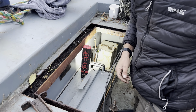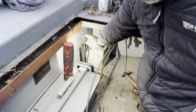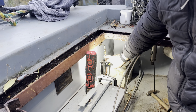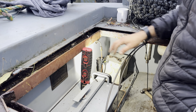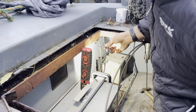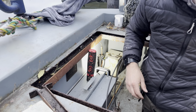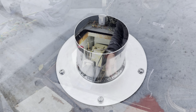So that's a diesel shut-off tap. The siphon tap we've tapped into, reconnected to that. We've got six mil to eight mil, and then we follow it off in eight mil. That's an isolation tap - there was one there before, we've taken that one off. And is there another one inside the boat? There will be one next to the stove. Brilliant.